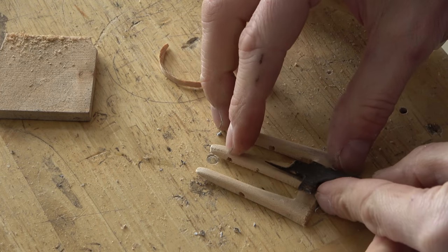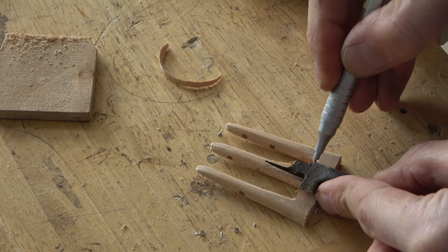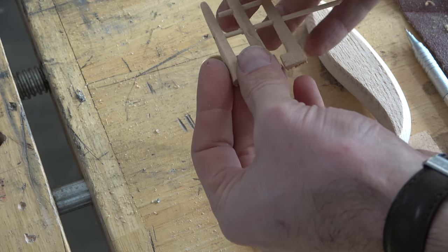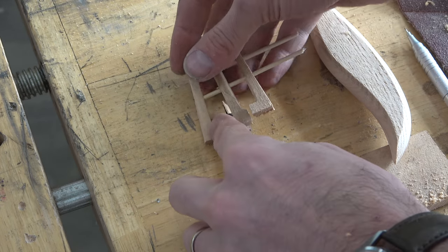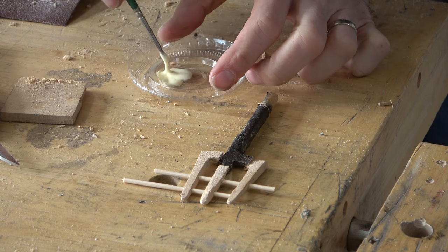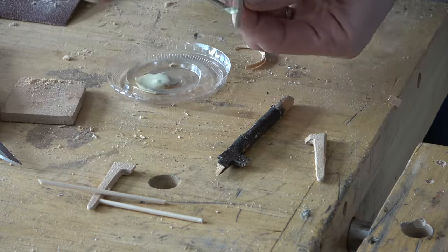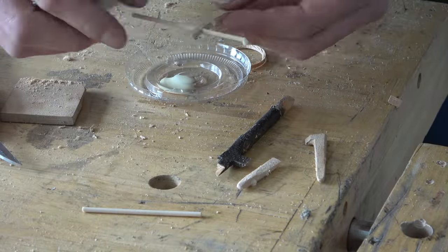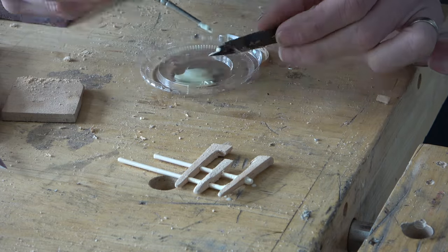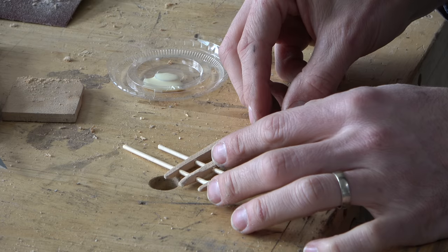Until I have the rough shape, at which point I have to figure out how to attach the new piece I've just spent a lot of time making to the old piece — and that means cutting the new piece into pieces. I have started to shape the contact points to make sure it will line up with the old. Once I've worked it some more, I will begin the glue process. I am using a standard wood glue here, because I want this to be permanent — I don't want this to ever come off. So glue on all of the contact surfaces, I will assemble it, put it all together, say a little prayer to Saint Arnold, and then give it time to dry. Hopefully it won't fall apart.